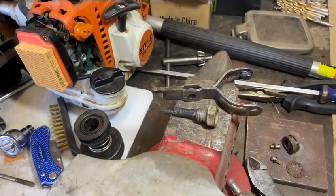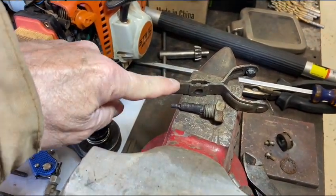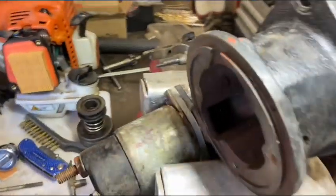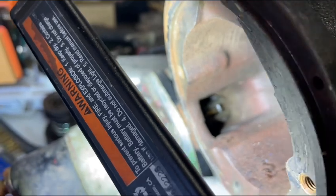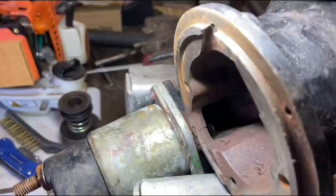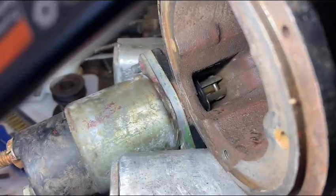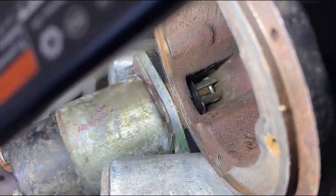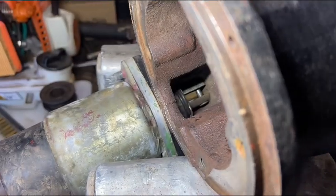Well, I found one problem. This tip of the engagement fork, this fork was in backwards. You can see, maybe, focus down inside there. That fork engages that pin, the end of that shaft there. And it was in there backwards.